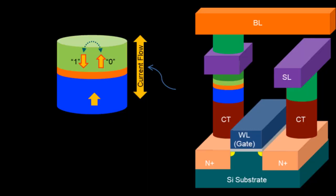MRAM is different from flash memory, which uses a capacitive charge stored on floating gate MOSFETs. MRAM instead uses the magnetic spin of a material. There's a permanent magnet and an electromagnet that can sense and write the polarity of each little bit, setting it to north or south — one or zero. The cool thing is it's incredibly fast. It has the same read speeds as flash but the same write speeds as read speeds. You don't have to erase and you don't have to wait — you write something instantly, the magnet flips, the bit is stored, and you can write any bit anywhere at any time. It's truly random access writing.